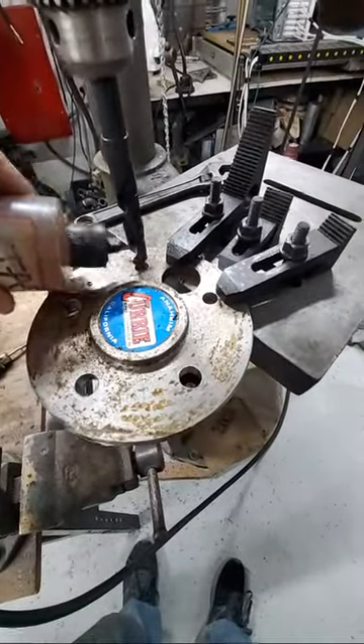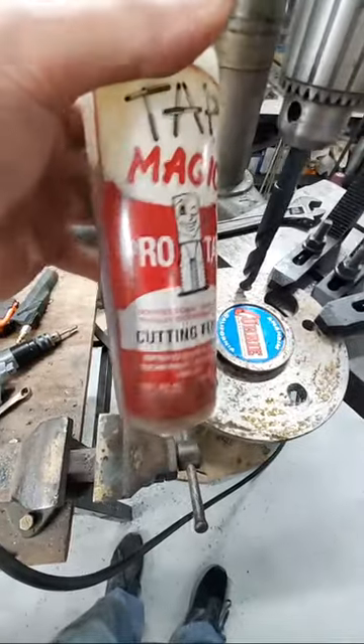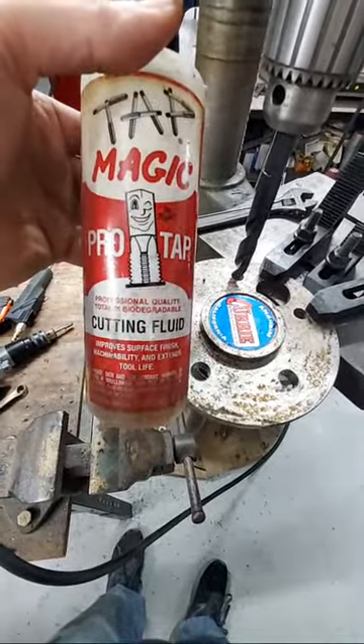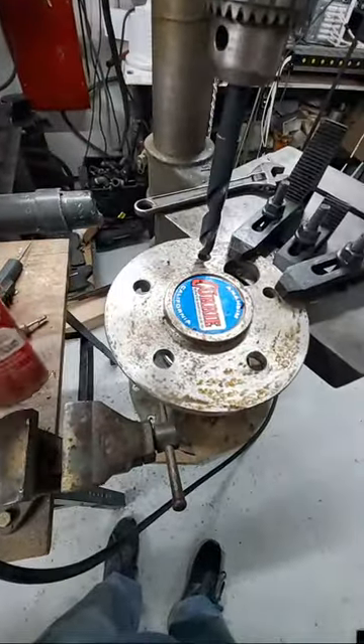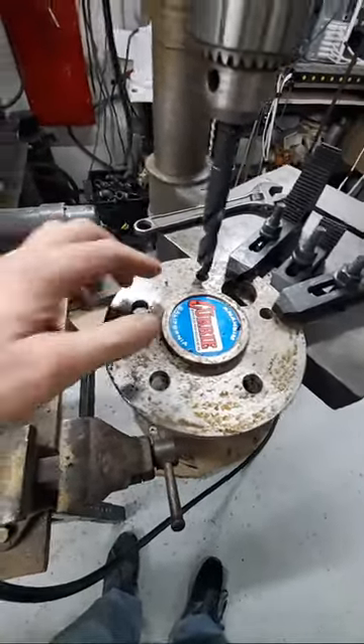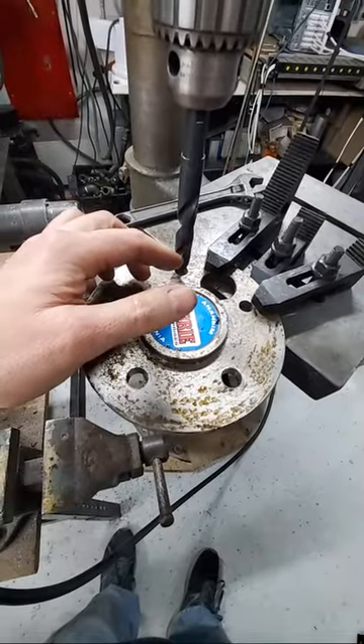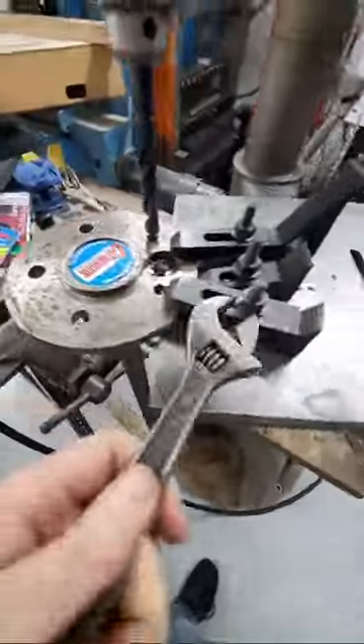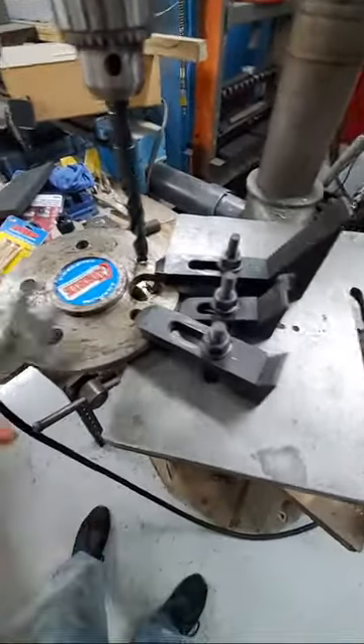Put a little cut magic on here — this is a type of tap magic, a type of cutting oil. It stinks, but it works to keep the edge of the cutter cooler. You'll get a lot of smoke that stinks, but that's what you've got to do.